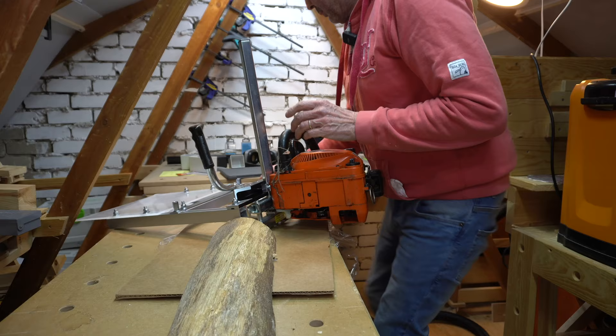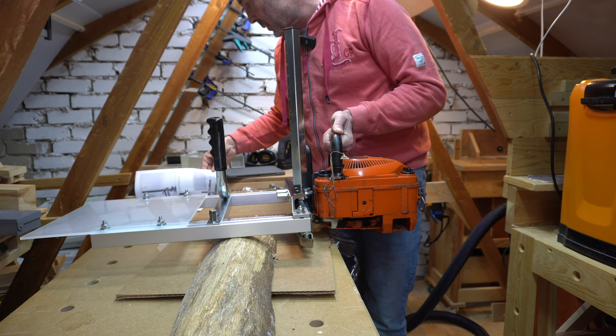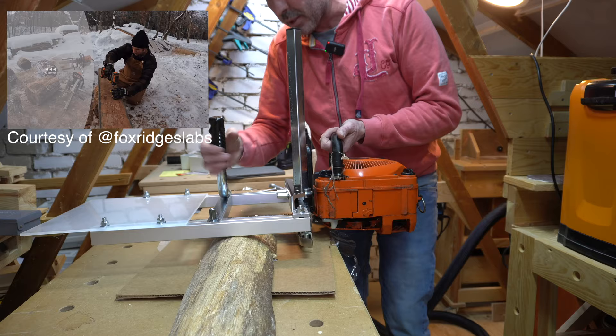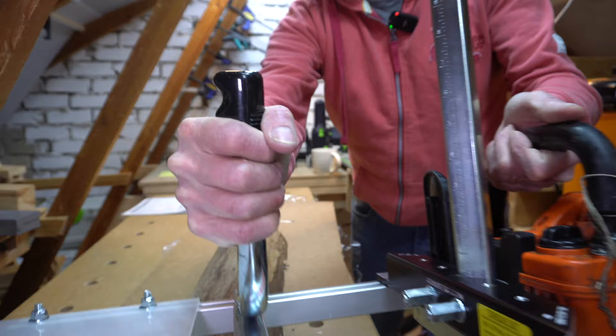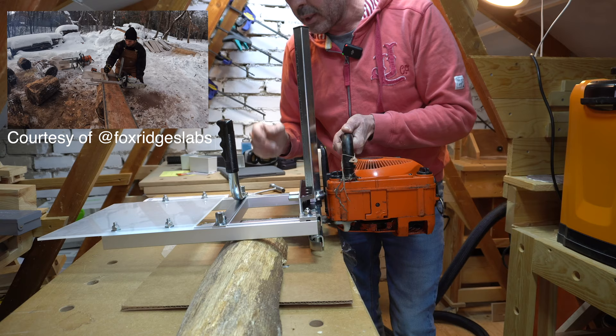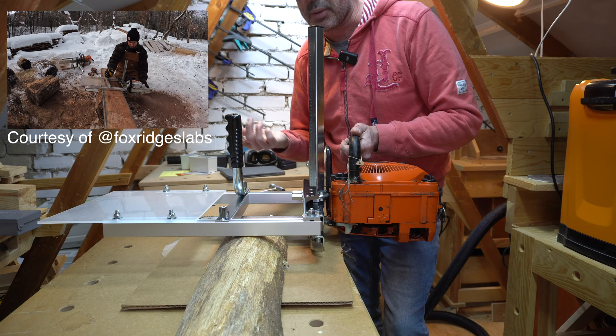You start the chainsaw up and cut. I've seen people cutting down a ladder — I've used a ladder myself with router sleds — but basically this follows the contour of the log. I've also seen people set the log up with guide rails so the first cut is absolutely spot on. Then once you've got a nice flat reference surface you can move the depth down — from half-inch minimum all the way to 12 inches. I'll probably cut two and three-inch slabs to go across the saw.